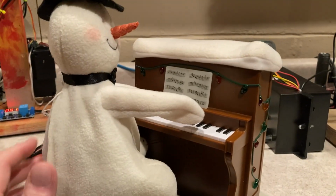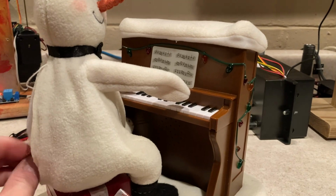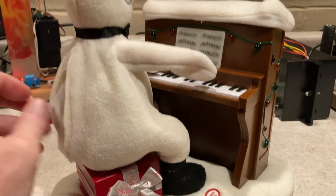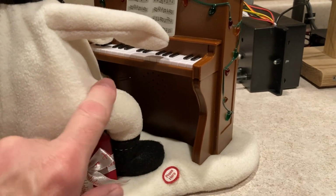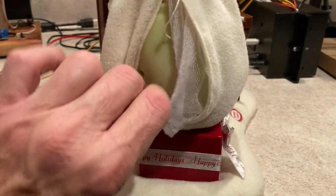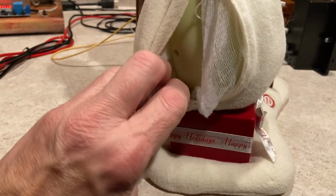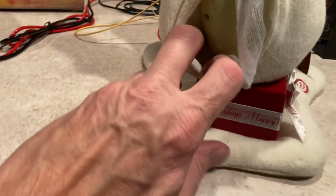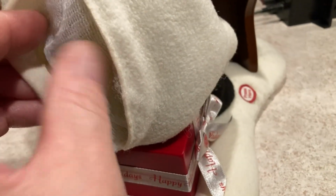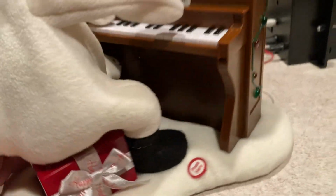One motor in here doesn't work, I think, I mean, it has to be, because the circuits just don't add up. There's 5 wires that run up to the inside of this, up to the other leg, this one. And they come in right down here, this lower quadrant. So there's 5 wires, and there's 2 leaf switches in there that tell the controller positioning.